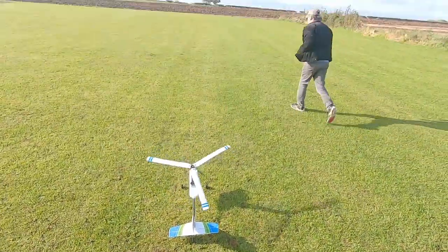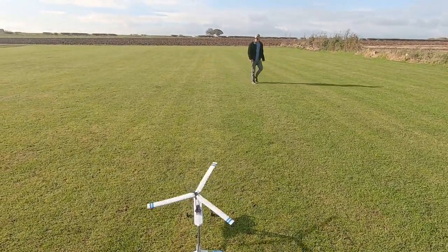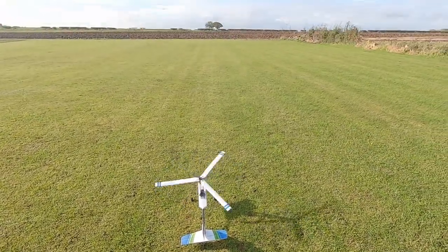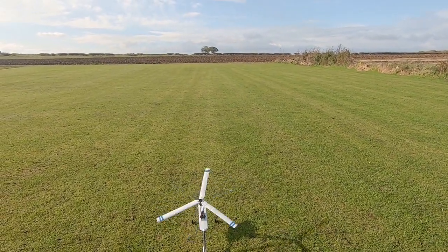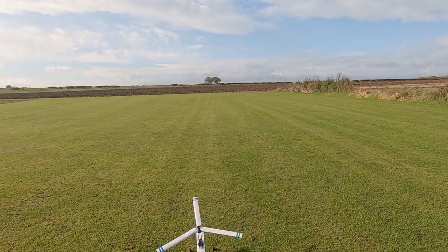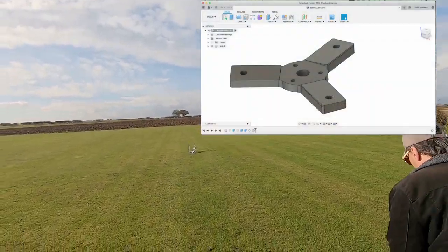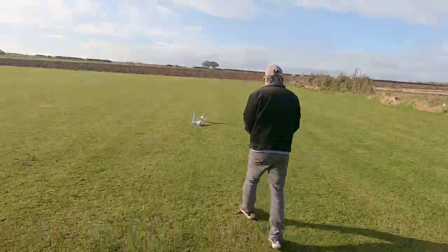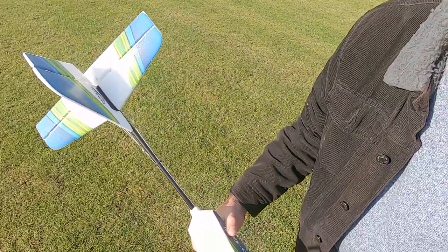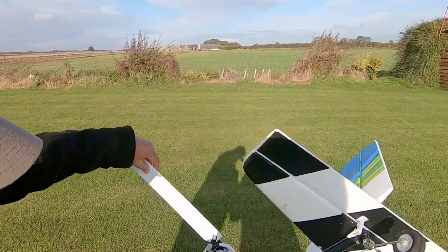I did try a couple more take-offs, but the 3D printed rotor hub broke and one of the blades became detached. I don't know whether that's from the crash or from the take-offs, because it did seem to tip over for some reason — something got a bit out of whack. On this attempted take-off it just went to one side, which is when the rotor hub broke. I've reprinted another rotor hub with the 3D printer, modified in Fusion 360 to be a millimeter thicker, still with 20% infill. I've printed two this time so I've got one as a spare, and I might try doing them solid to see how it goes.